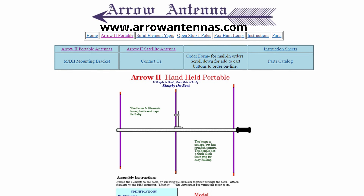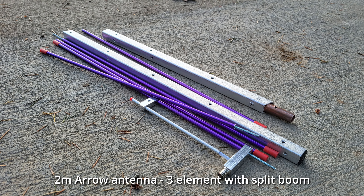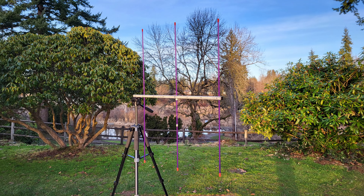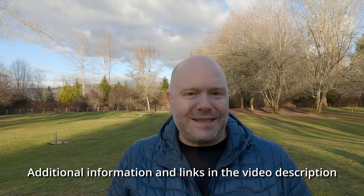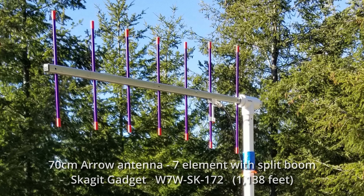The best or highest gain antenna you can use is a directional antenna, and my longest contacts — 150 to almost 300 miles — were made with some sort of directional, either the Elk Log Periodic or an Arrow Yagi. Starting off with the Arrow Yagi, I have a couple of those and started using them first. They're great antennas and a lot of folks use them. They'll hold them in their hands when activating, attach to a tripod, or attach to a walking stick. Activators also find ways to lighten the antenna by changing the mast. The Arrow antenna is great especially for 2 meter, and I've also used it for 70 centimeter.